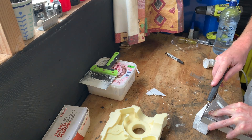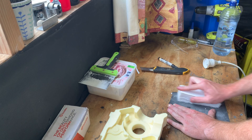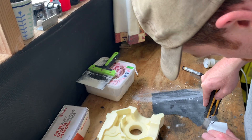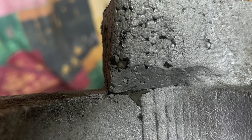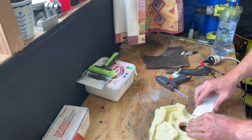As you can see, the sprue is actually quite rough after being cut with the craft knife. I wasn't too concerned about the surface finish on the sprue as it is just sacrificial and would be getting cut off at a later date. I was quite surprised that all of the imperfections in the expanded polystyrene foam were captured in amazing detail — here you can see a close-up of all the little foam beads making up the foam. I'd also like to give a shout out to the fourteen-dollar Azito hot glue gun and the world's cheapest hot glue sticks, as they performed amazingly.